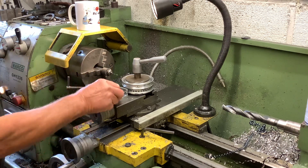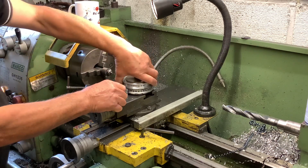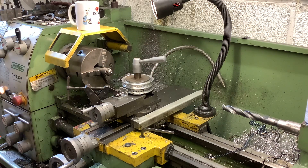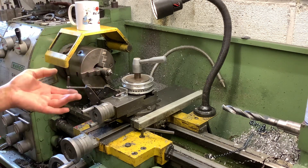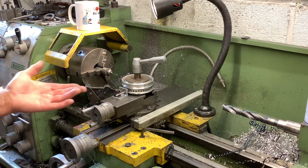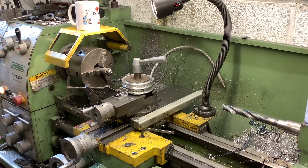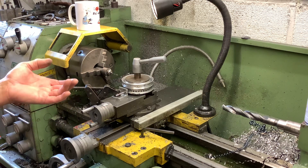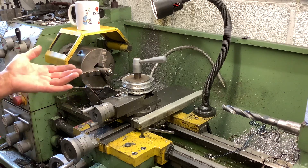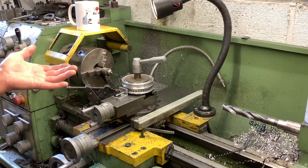This pin is a bit of silver steel turned down 3mm at the end - you just unlock it, turn it round, put it in and drill your next hole. It would be nice to have a proper indexing head from Warco. I've got to make a front rim now - it's bigger diameter so I need a bigger fixture, which means buying more ally.